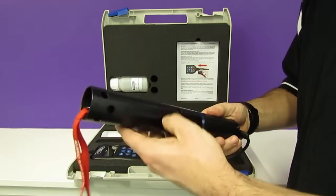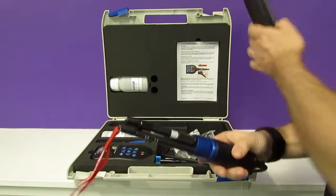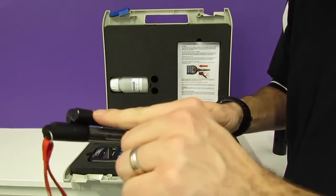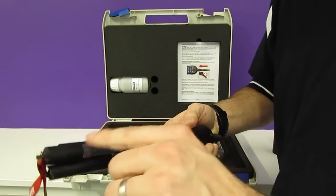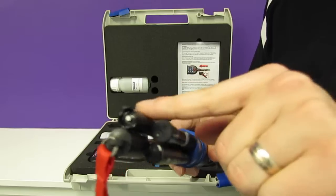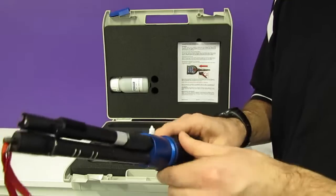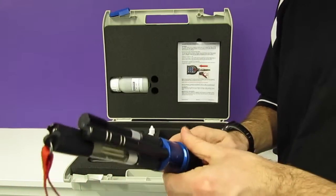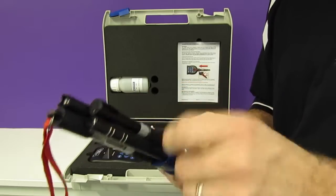Let's take the sleeve off and have a look at the differences between this and the 2000. It's very similar on the inside. We still have our 4-ring conductivity. You'll notice there's no dissolved oxygen on the end. We have our PH/ORP sensor, and then here we have our galvanic dissolved oxygen sensor. So the AP800 uses a galvanic dissolved oxygen method. We also have in one of our ports a turbidity sensor. So the AP800 will do PH/ORP, temperature, conductivity, dissolved oxygen, and turbidity.